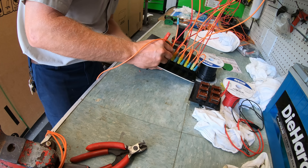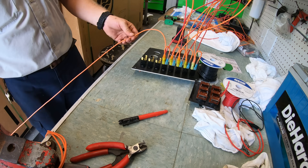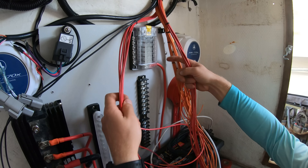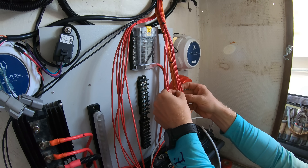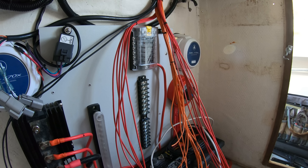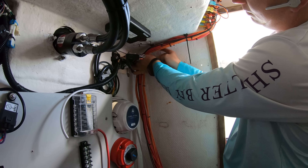As you can see, it's much easier to just wire up this panel here in the shop, then take it out to the boat to install it as a solid unit. That's where that junction bar comes in super handy. If we didn't put in the junction bar, we'd only be able to wire up half the panel while it was outside of the boat, because we'd have the positive wires coming from the switches out to each individual component that would need to be added once installed. But since we used the junction bars, we could wire up the orange wire from our switches to the junction bars and the red positive wires from the fuse panel straight to the switch panel, making it a lot easier and quicker to put back into the boat.